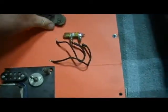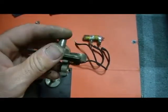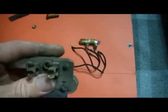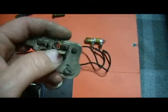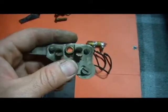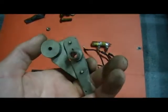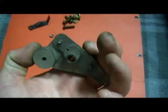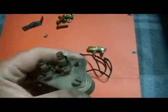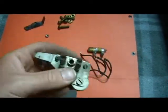If you look, this is the bit that rocks backwards and forwards which has the mercury switch on it. There's a nice brass bushing in there. I'll check that with a set of calipers and make sure it hasn't gone elliptical. I doubt it, but if it has, we can always knock up something. I'm sure it'll be fine — it's only a relay, it's not that precision. It needs a clean though.